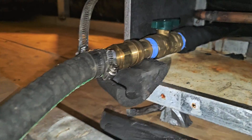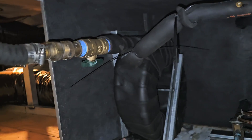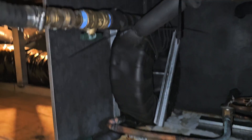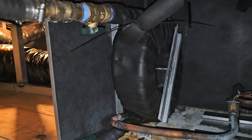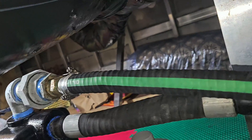Here's the coaxial — I replaced that coaxial. Anytime you've got a big pressure drop across a coaxial, it's an indication that it could mean the coaxial is stopped up. Sometimes you can wash them out and sometimes you can't — it really depends on the buildup and the application. It pumps the water in, through the pump, and then it goes into the coaxial, and then it pumps the water out and dumps it right outside.